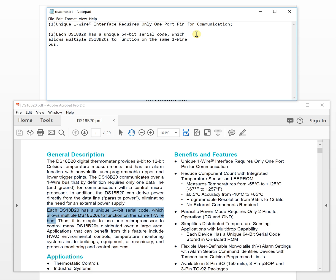This means on just two wires you can have multiple devices on the same bus — it's amazing. You can imagine 100 temperature sensors all running on a single one-wire bus, which including ground is only two wires. This saves lots of wire, greatly simplifies hardware design, saves cost, and is very convenient.